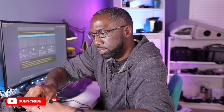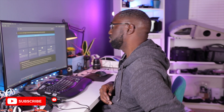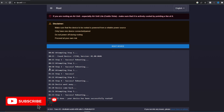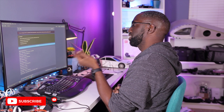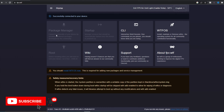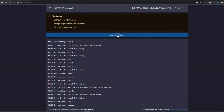We do the same thing now for the actual air unit or Vista in your drone. We're going to power up the drone, use the same USB cable, plug it into the air unit, and root it with the same process. COM5, connect. That took a minute and 47 seconds. All done — your device has been successfully rooted.